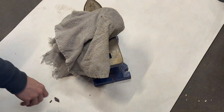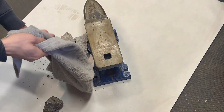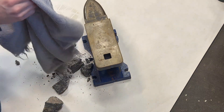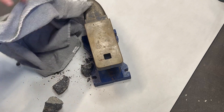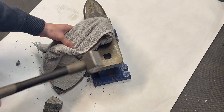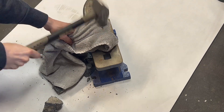So I hope to recover a few grams from this ore sample. The reason for breaking up the ore was firstly, it wouldn't have fit in the crucible — I only have a 10kg crucible to fit in my furnace, so it has to work with my 10kg crucible. Secondly, I need to break it up to increase the surface area so the reaction can take place quicker.